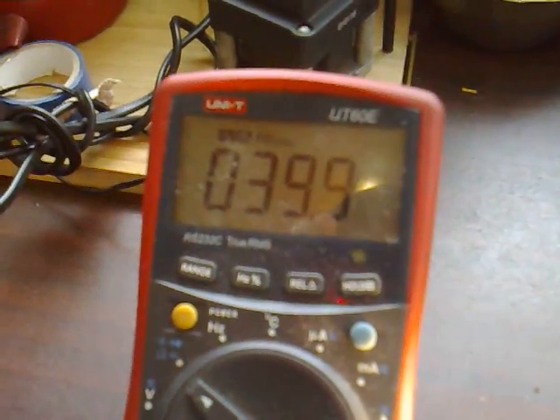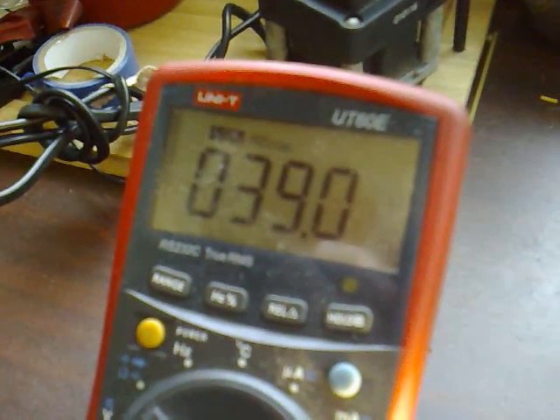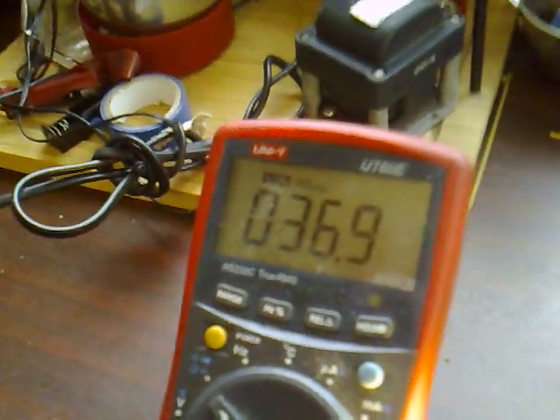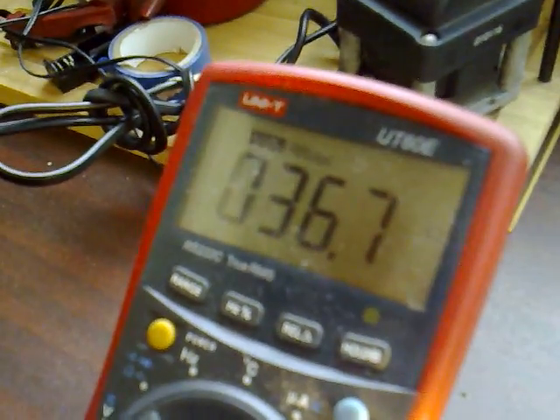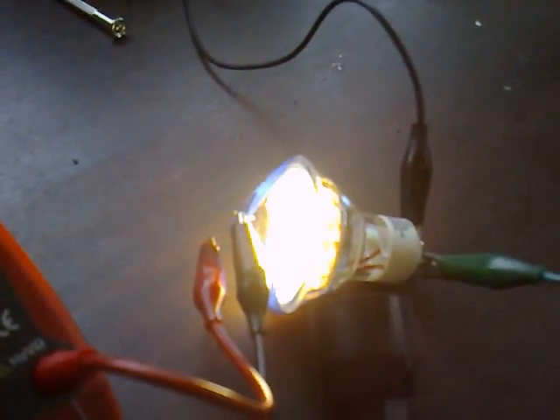I can increase the brightness with this variable resistor here. Moving it and you can see the ohms meter coming down. Using an LDR — a light dependent resistor — strapped to the front of your bulb is a handy way of checking any changes to your circuit. Is it actually making a difference in the light level? Because it's hard to make a judgment just using your eye. This is nothing groundbreaking, but it's handy for people who are experimenting and want to see if any changes they make to their circuits actually makes a difference.